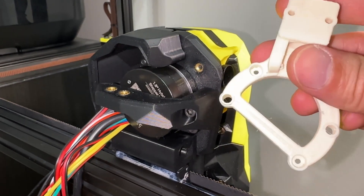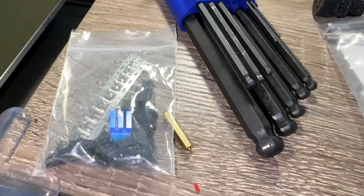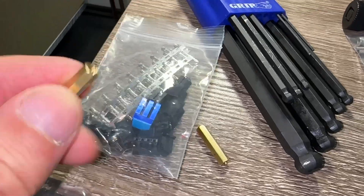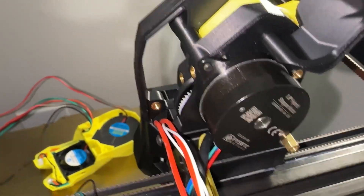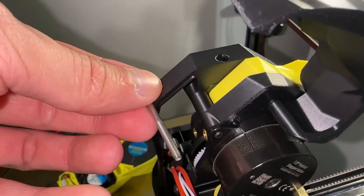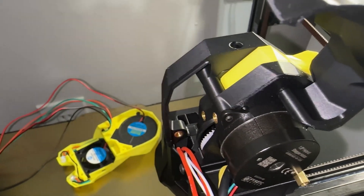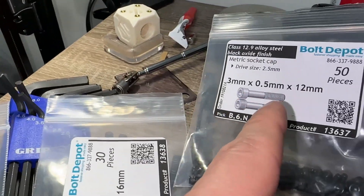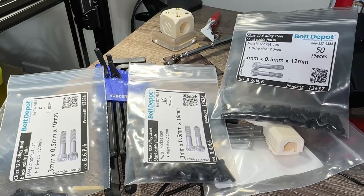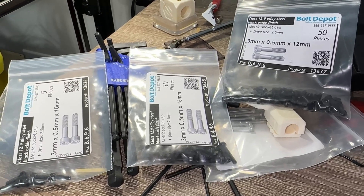For the Stealth Burner, we need to attach a piece to support the EBB36 CANbus board. The bridge needs to go since we aren't using the X cable chain. The bag that came with the board includes all the necessary hardware, including standoffs. They attach to the screws that mount the NEMA 14 motor, which are a bit short. On the left side, I am replacing the M3x30 with a 40mm length screw — honestly a 35mm fits better, but I don't have that. Work one side at a time so we don't mess up the gear slot set previously. The smaller M3x8 screw on the right can actually be left alone since there's enough thread to catch the standoff. I went with the 12mm long screw since I have a lot of those left.